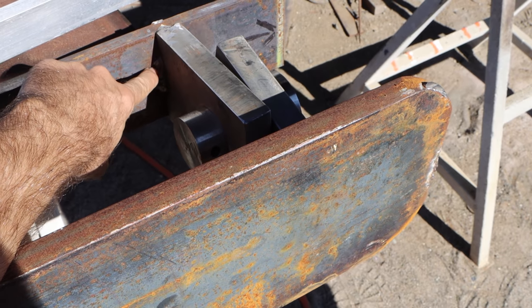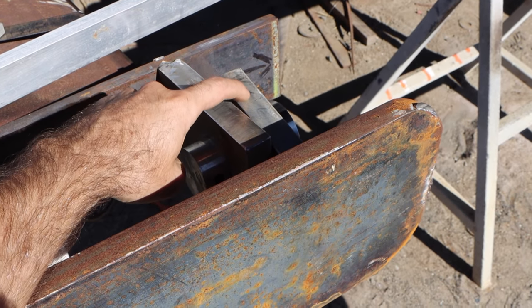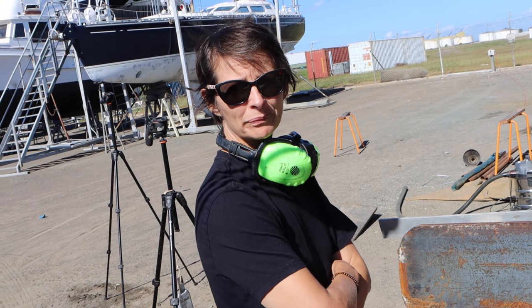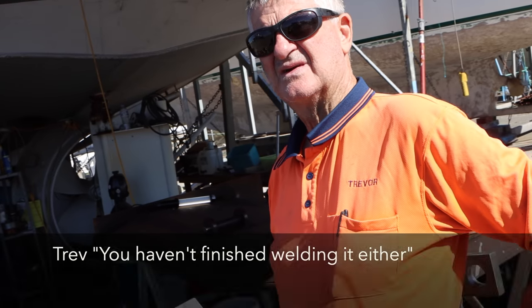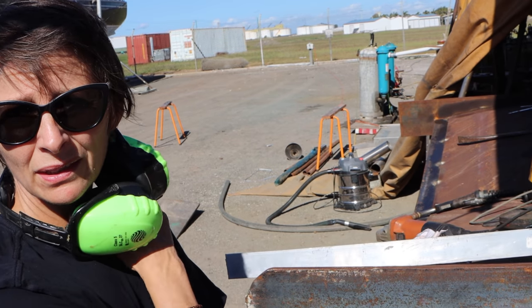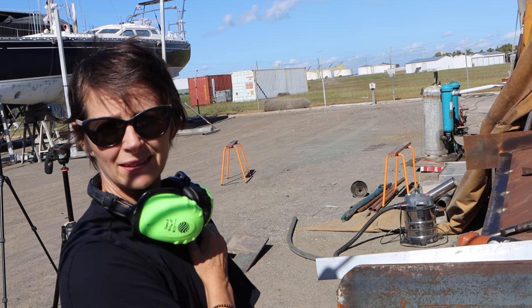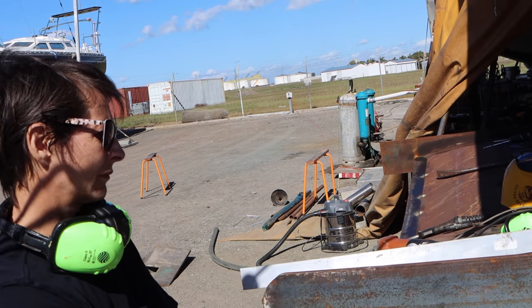I think we have to cut some of these tacks off and align it more accurately so it doesn't exaggerate what's going on when it starts to move. Actually, the other thing is I've welded it all on now, so it's probably warped a little bit from the welding. They haven't finished welding either, so maybe we should actually finish that welding now before we get too much further. It's not going to take long to buzz that - just grind that slot out and weld it.